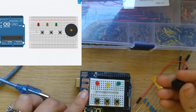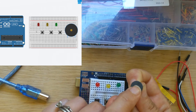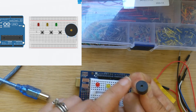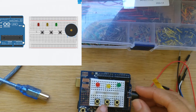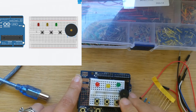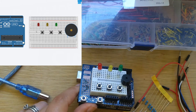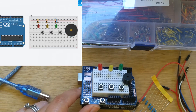Here's our piezo buzzer. Make sure when you put your piezo buzzer in, you'll notice that there is a little tiny plus side that is etched in. These are like LEDs — they're like one-way streets, so we need to know which one is which. I'm going to put my plus on the top, and I'm going to jump this gap on the very last column with my little plus sign on the top. This is all of our circuit components added into the circuit and we just need to wire things up.